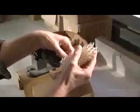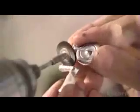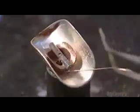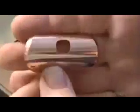Using a pneumatic cutter, craftsmen snip off the key parts. They have a dull finish because the silver isn't yet polished. Now they solder the key parts together and polish each finished key with a soft rotating brush. They also solder on a riser, which attaches the mouthpiece's lip plate to the head joint tube. They cut away excess metal from the opening of the lip plate.